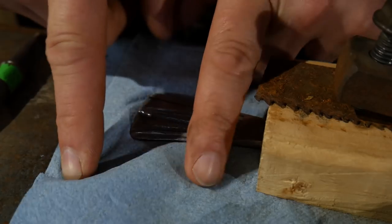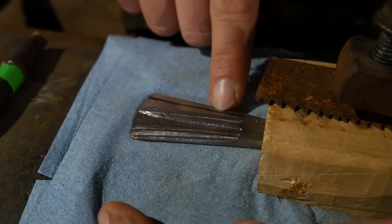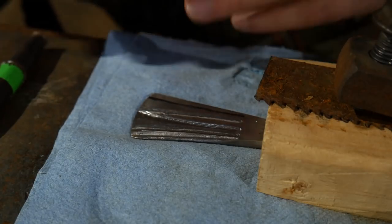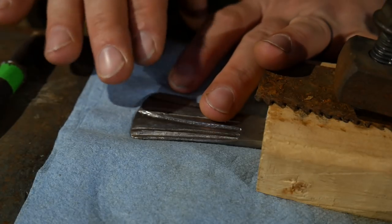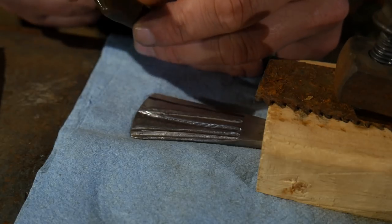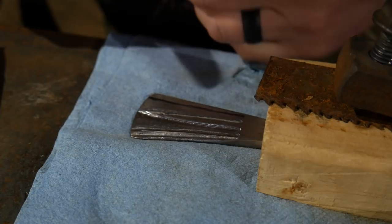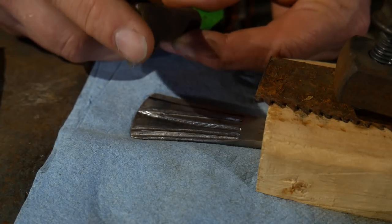The last part is a simple fuller line. I've got a double fuller — we started with the inner fuller, indicated by this black sharpie mark, and then I fuller along the outside edge with an outer fuller. I used an eighth inch fuller and a sixteenth inch fuller — that's a sixteenth inch radius and an eighth inch radius — to do the fuller lines along here. I also used a slightly larger fuller to kind of get things started since it's a shorter, easier-to-control tool. Basically you come right on top of your black layout line and just hammer, taking little bites and following generally the line you've laid out.